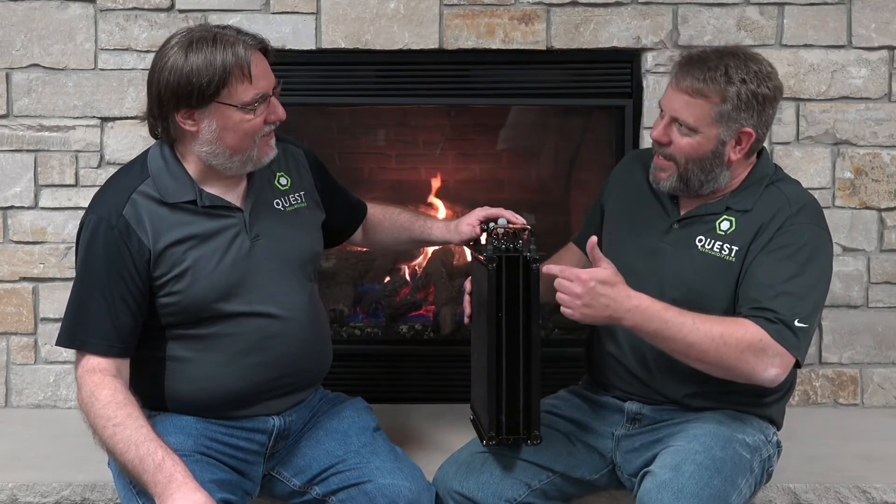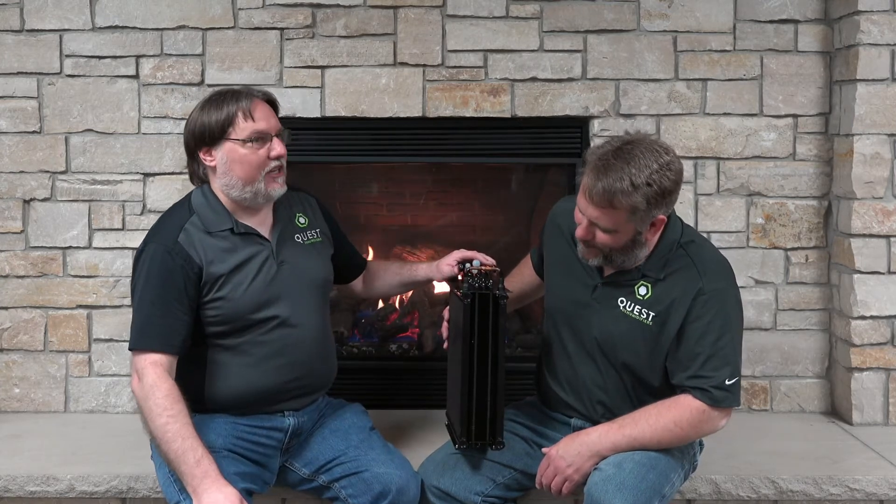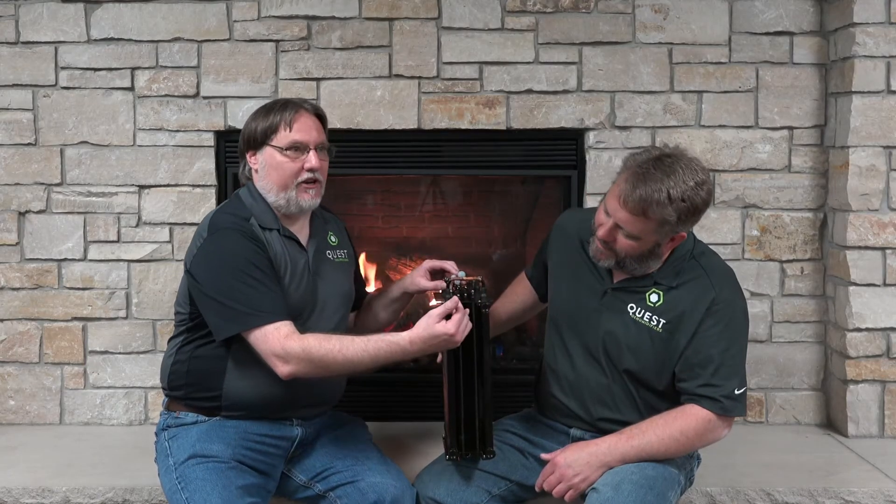So right here, between the second and third coil, we've got 50–60 degree air coming out of that evaporator — especially when it's 90 degrees outside, like we are in front of the fireplace. I've got 55-degree air hitting this third coil. The refrigerant has partially evaporated, and now it's dropping into this third coil. It's like an energy drink — it re-energizes the whole evaporator and gets as much energy as it can hold. So I'm recycling the refrigerant in the third coil, and then it goes straight into the evaporator with fully regenerated refrigerant, using all the energy we possibly can.